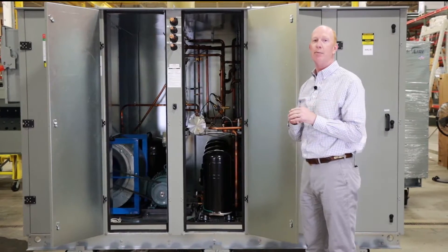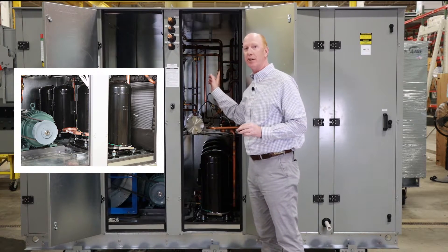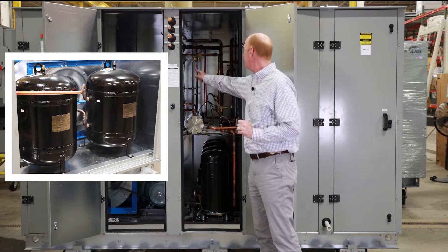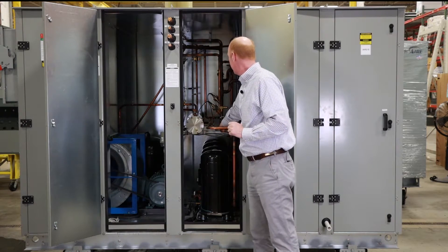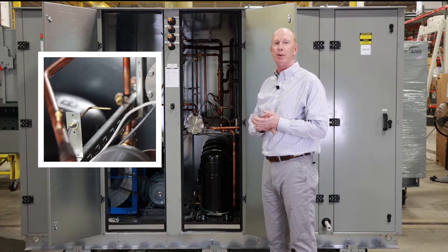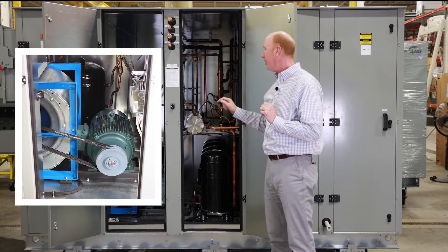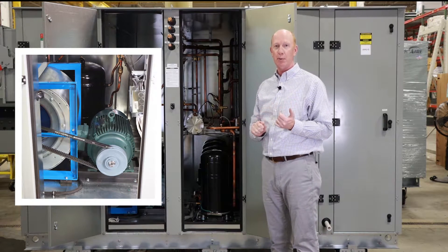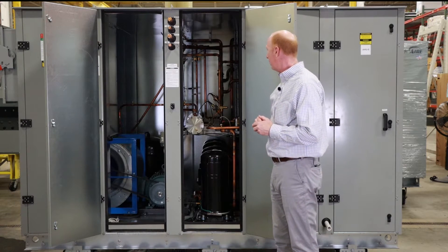Now we're into the main part of the refrigeration area. The B circuit compressors are on this side and the A circuit are on the other side — those are on tandem scroll sets. You've also got receivers tucked in the corners, labeled A and B, along with filter dryers and pressure transducers. There's also the pickup tube for the differential pressure transmitter for airflow. These units are equipped with belted blowers and are VFD driven. The VFD increases fan speed under high sensible heat requirements and lowers speed during high latent load conditions.